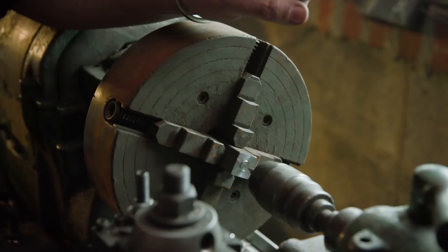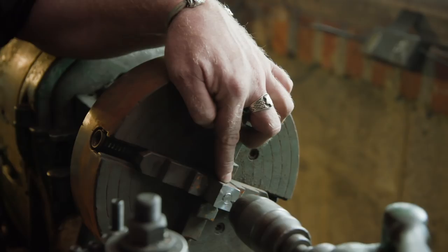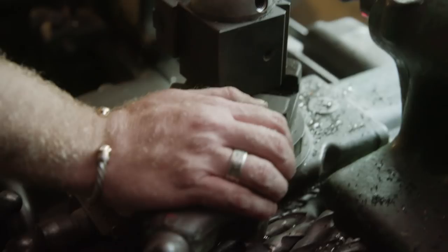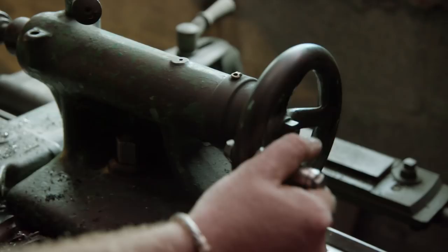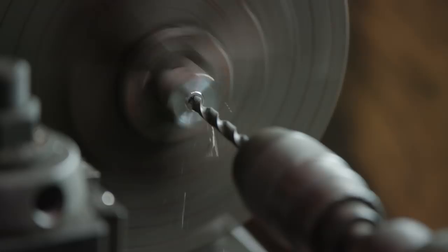Since we're forging this piece from a one-inch piece of square 1080 steel, I'm going to be using the lathe with a center drill to set a hole in the backside of the bar that's going to be forged into the blade on this rapier. A bolt will go down inside of the cylinder of the sword and will pull this blade into place. The reason for that is we don't have a long tang because we've got a cylinder there that has to be able to rotate and break open. I'll drill that center, drill down into it to take the material out, and after Ilya's finished forging I'll do the tapping — if I do it ahead of time, the threads could be warped from the forge.